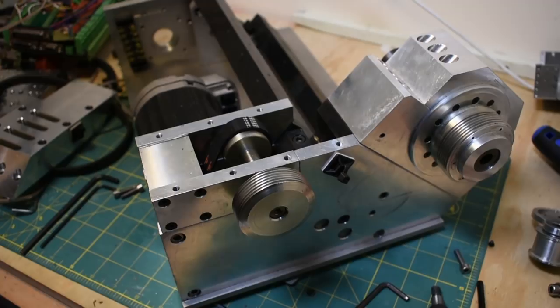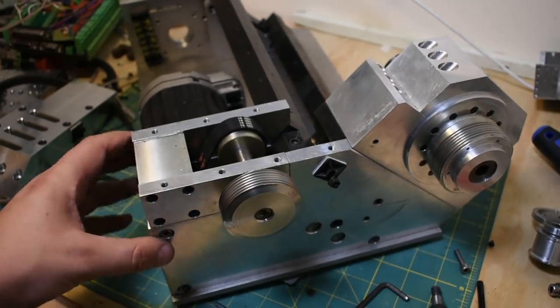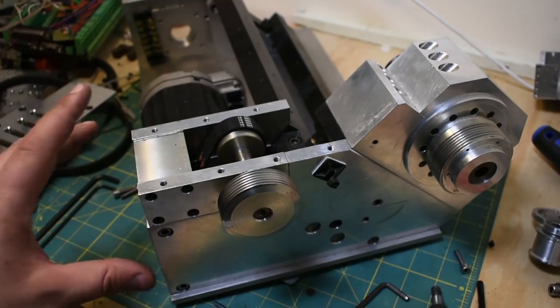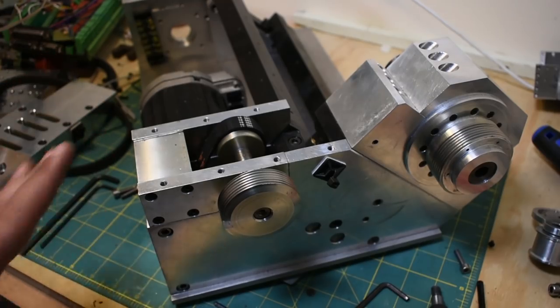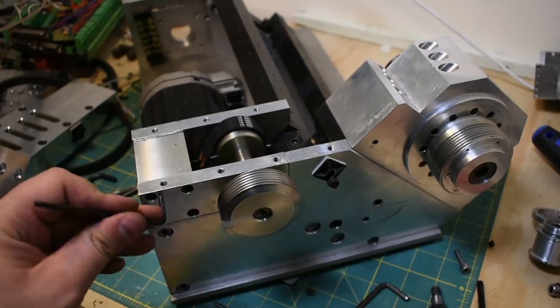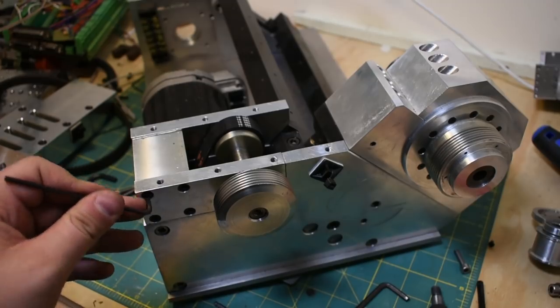I can't go out and order huge pieces of material, although you kind of see why lathe manufacturers do that. But I basically use the material I can find, and a lot of the times that's teeny little pieces that I bolted together here and there, and I built it up like Lego blocks. That is really inviting not only difficulty taking things apart, like we're finding out now, but also every time you have to join two parts, you're inviting misalignment. So yeah, it's certainly not a good way of designing.